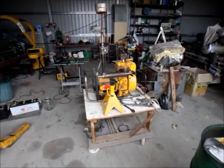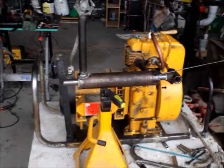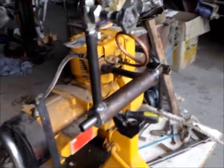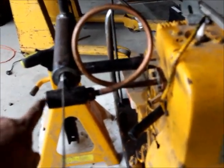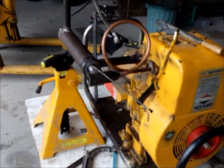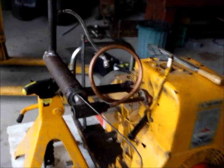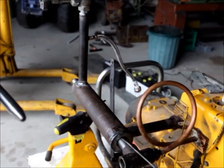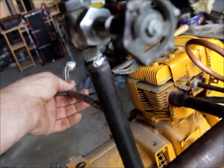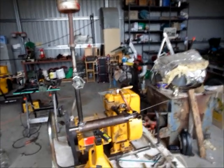Here we are again with the reactor. I'll put it all together here — I've got to weld it. I've got my 14 inches of vacuum coming out of here. There'll be a tap going there to regulate the airflow, which is kind of like your throttle. Then the other thing is to just weld this reactor together. I do have the reactor rod, which is here — that'll slot in that way. Then this gets hooked up. I've got just a really basic bubbler, and of course that mushroom upstairs, which is a smokestack — which is the muffler.